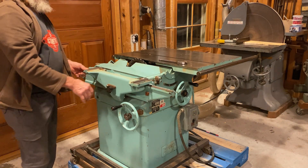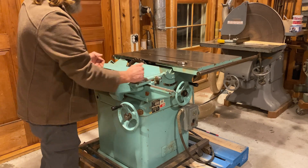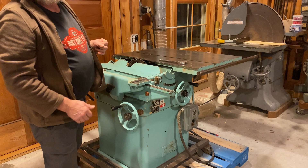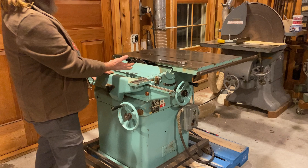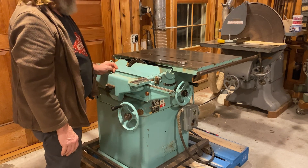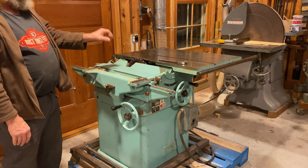It's pretty decent. It also has grooves for the table and you can open two inches horizontally for dado stacking and molding heads. It's hollowed out on the bottom side of the table to allow the bearing pack to come up. With a 12-inch blade it achieves three and three-quarters of an inch, and the rise and fall covers that all the way.